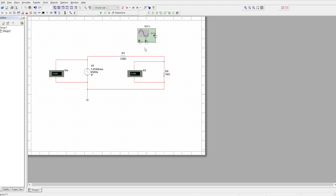Here's our oscilloscope. We're going to place it on the top. Make sure you connect channel one — connect it to the positive on top. Now we're going to grab the channel one negative, make sure we put it at the bottom, right next to that voltmeter. Channel two positive — we're going to put it at the top again, same thing, top of R2.